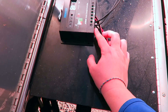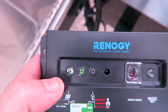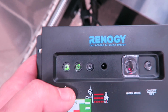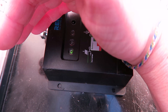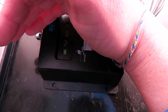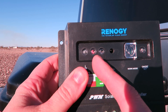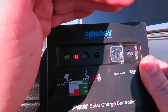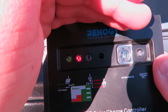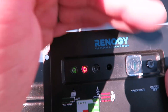There isn't any setup required for the charge controller — no buttons you need to push. You want to make sure you're seeing the two green lights, which means the solar panels are bringing in energy and the battery is receiving electricity. Right now it's blinking because our battery is at 100% capacity. When it hits that mark, the controller shuts off the energy flowing into the battery, protecting your batteries from getting overcharged. When I unplug the charge controller, you can see we've got a green light and a red light. That red light shows there's an error connecting to the battery. That's a good way to troubleshoot any issues with your charge controller.